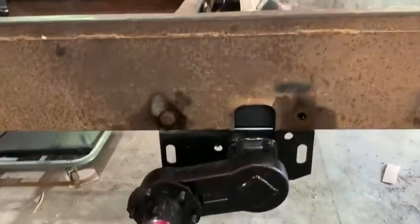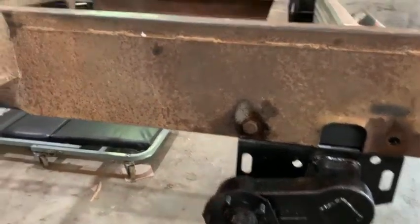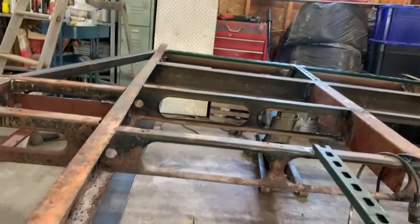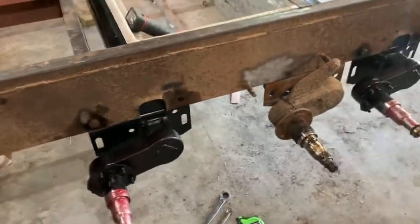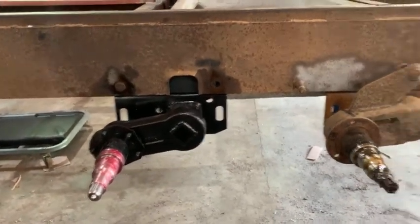Basically, they're mounted directly center where the old ones were. They're just dropped down 3 inches because I have the angle iron that doubles as rear structure support. And also the 3-inch lift. 10-degree axles. I've been told by several people the originals were supposed to be 22.5.